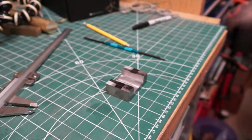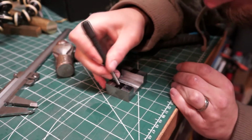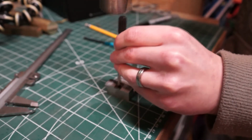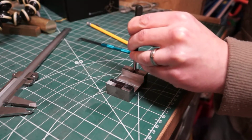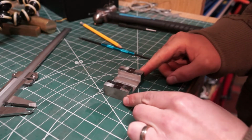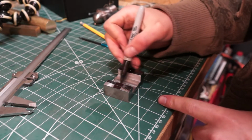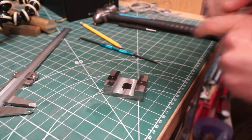That's going to be used to secure the little metal bracket that's going to go over the top and clamp down. The one in the centre is going to be for a standard, I think it's a 1/4 inch by 20 threads per inch imperial thread, which is the standard for cameras and tripod mounts. So hopefully I can either find a tap or I'm going to have to buy one for that.